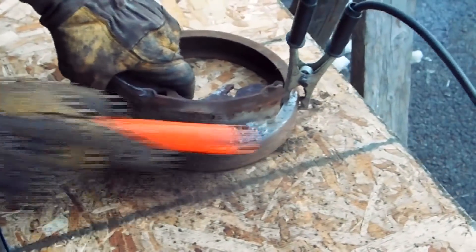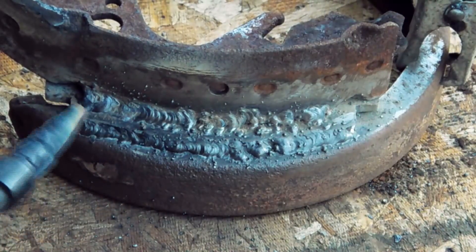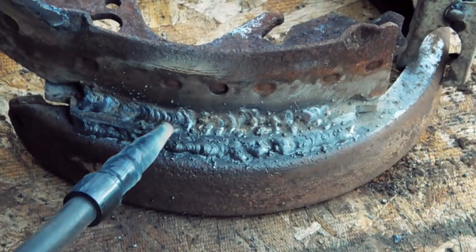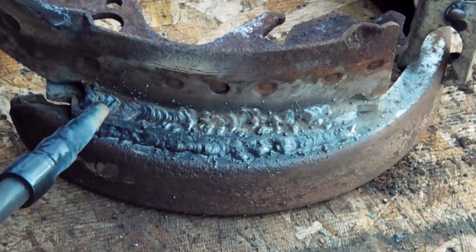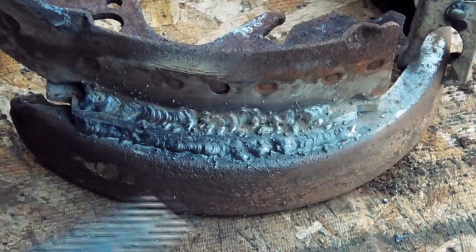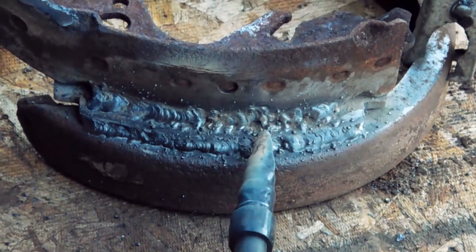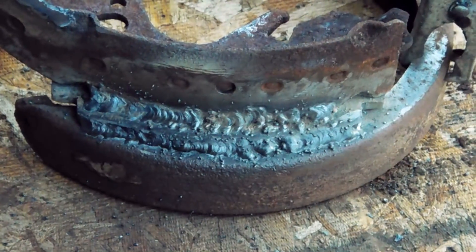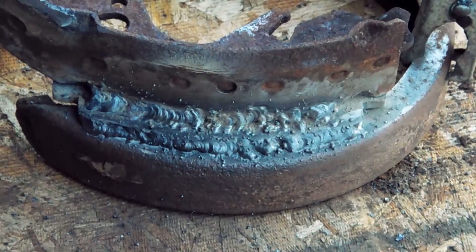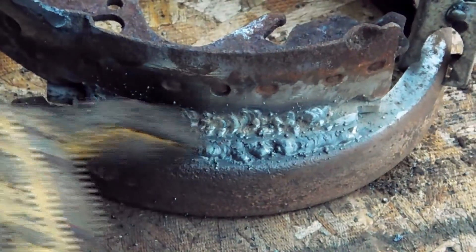Check that out — it felt a little better. This is the weld up here, from here to here is wire feed setting number five, and I was taking my time with my zigzags — going very slow, very deliberately zigzagging back and forth. I think this is more of how a flux core weld should look, rather than down here where it was number six and I was probably hurrying. I can see the individual zigzags, so I should have gone a bit slower. But for me — the novice, the beginner — feed number five at maximum amperage gives a pretty good weld. It's solid and fills the V in there really well.